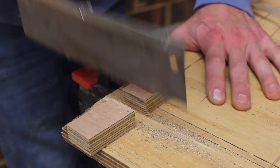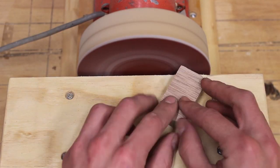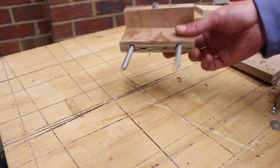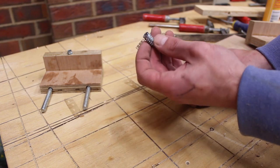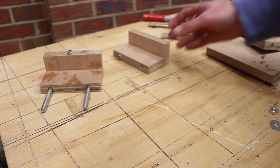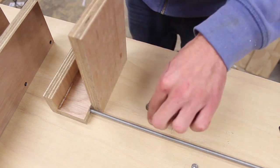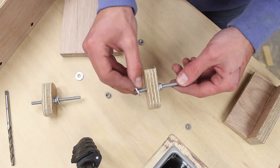I'm using some scrap pieces of plywood as the knobs for the handles. The homemade disc sander comes in handy here — you can check out that video on my channel. I had two failed attempts making the fence clamp. The first one I epoxied in turned out to be junk. The second one I didn't drill wide enough holes, so when I attached the insert nuts it just shredded completely and I couldn't put it in any further or take it out. The third one I drilled a larger hole and managed to fit them in.